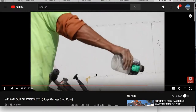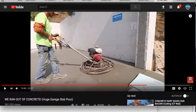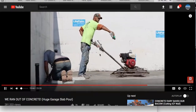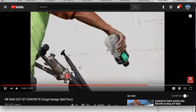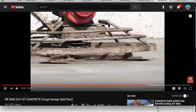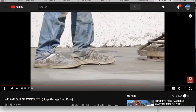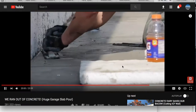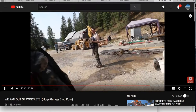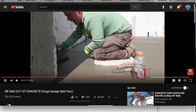I'm adding that water to this mix. All it does is weaken the surface. That is ridiculous, and he's got a concrete shirt on too, so it appears he's been doing this for a while. What it amounts to is he didn't have enough guys, he didn't know how to calculate the temperature in relationship to the weather and his concrete, and coming up with a resolution to make sure he doesn't have an issue. So it's just terrible — absolutely terrible.